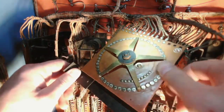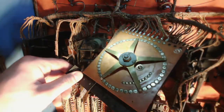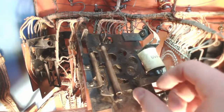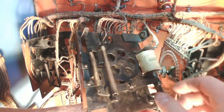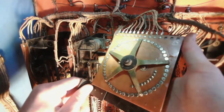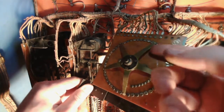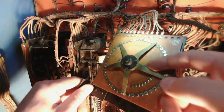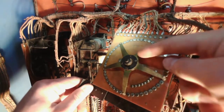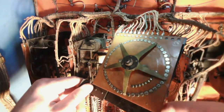Got this thing cleaned up, went through and magic-brushed everything, and did a little bit of the dry bike lubricant on a Q-tip. Also cleaned up the gears that had some old dried grease on them. Now it clicks along pretty nicely. The last thing I like to do is make sure that the tension on these fingers is nice and secure on the contacts. I'll take my switch adjustment tool and give them a little more tension to make sure you have good connectivity there.